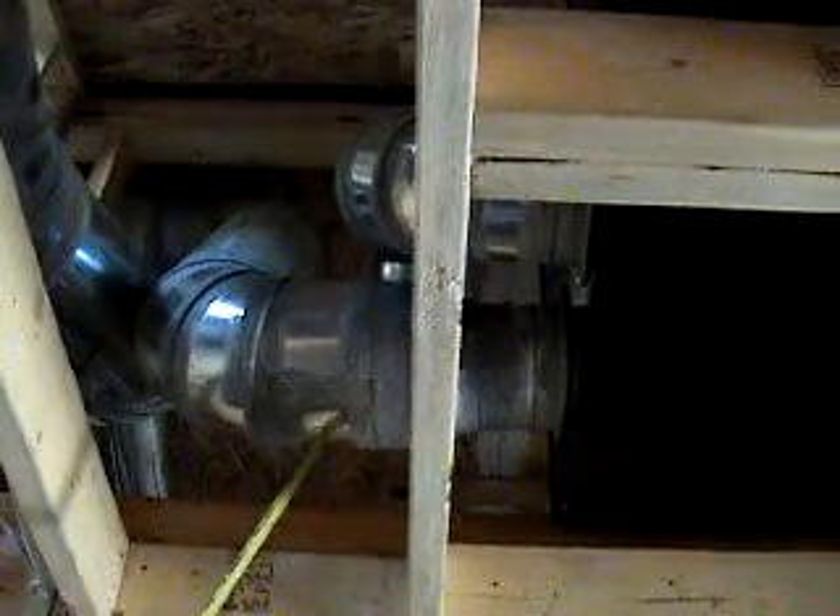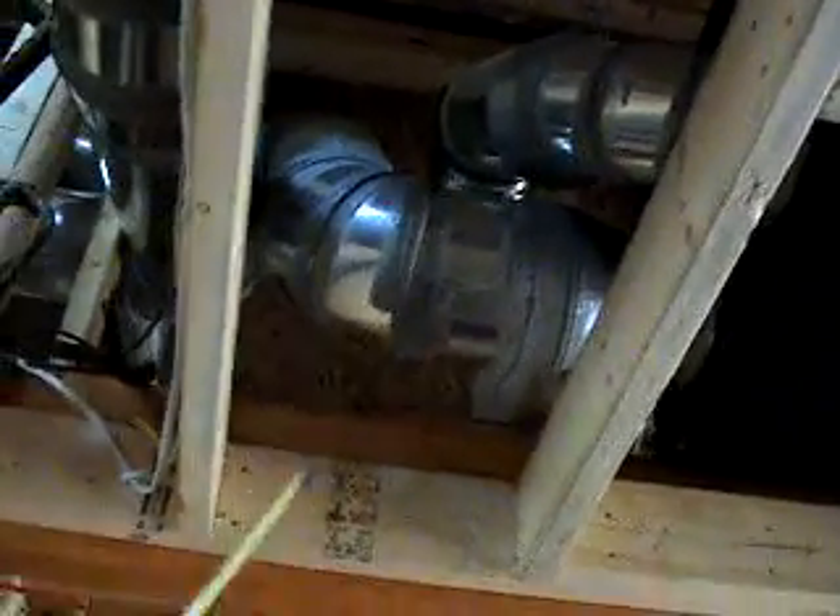This pipe is the air that is leaving the house — stale air. This pipe delivers fresh air into the house, and it's delivered into the mechanical room, where it will mix with the return air into the two mini-splits.